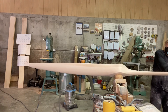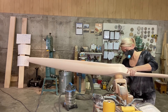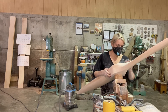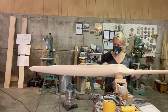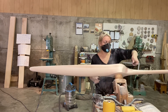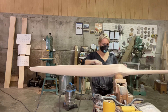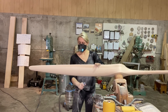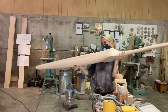When I balance a blade, I try to take all the material off the back of the blade so I don't change the airfoil much at all. I also make sure I do it so I don't change the pitch. What you look for when balancing: first, any defects you can smooth out that'll help your balance; then, if there are no defects, you start taking material very evenly off the back of the prop. At this point even a little bit of dust can throw off the balance.